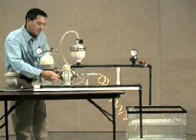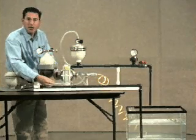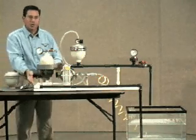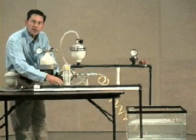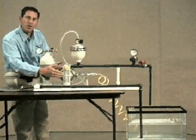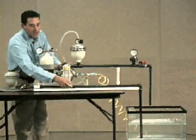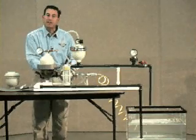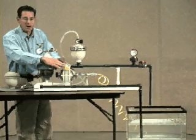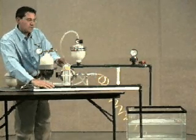As the pump strokes, the ball valves open and close, creating a water hammer effect, much like a quick closing valve. So as the pump strokes, the acceleration head is headed towards the pump. The ball valve closes, stops that flow, and reverses it. On the next inlet stroke, the pump must overcome that pressure wave going backwards, re-energize the fluid forward back into the pump. That creates a lot of stress on the pump and its components, including the diaphragms, and bounces around the inlet piping and hose.